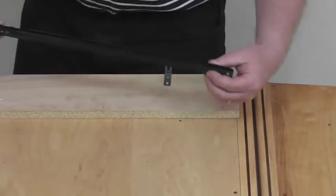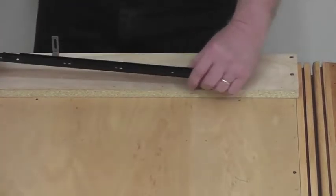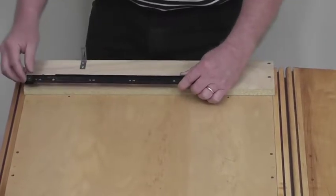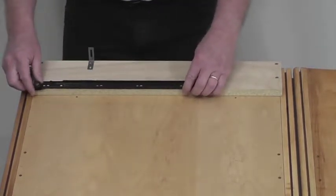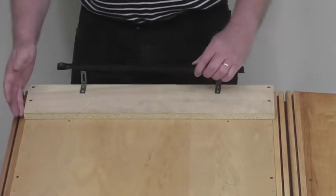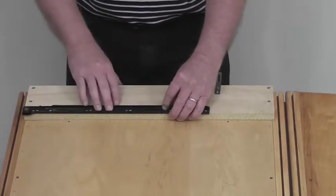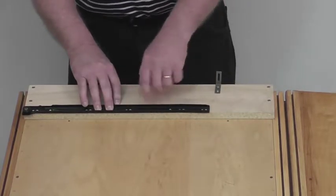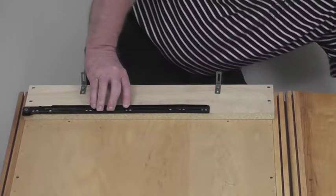And then these are stamped CL, meaning the cabinet. It's left, and that's what I'm going to use. There's a rib towards the top, and the wheel goes towards the front of the cabinet. So when we set this up, this will be in the front. This gets fastened using a 5/8 number 7 screw. You'll see it goes almost even with the front edge, and you'll see 2 holes that line up. Even though there are multiple holes, we only use the 2. If this hole is stamped out way oversized, you can hold it in the proper position and then use another hole if necessary.